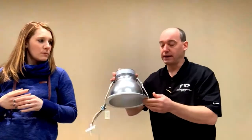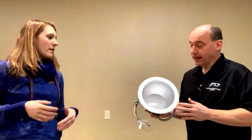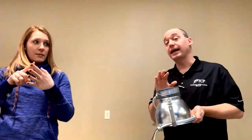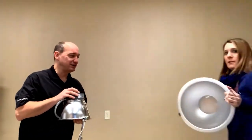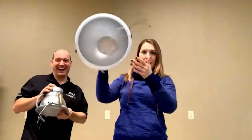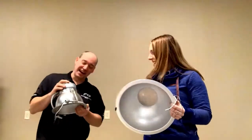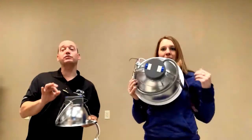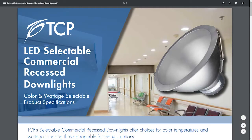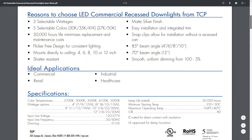It's got a cable that you can easily hook in and meet electrical code very quickly. Now, as far as the product line goes, we have many different sizes: a 4, a 6, an 8, a 10, and a 12 inch. The 12 is pretty large — as big as my head! On all these cans, they are selectable wattage as well as selectable color — three wattages, three colors, nine combinations, one can, across five sizes. That's a lot of combinations.